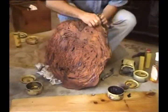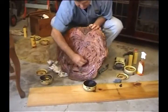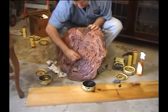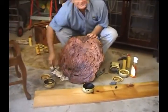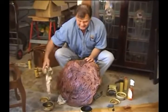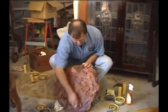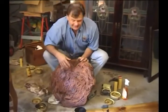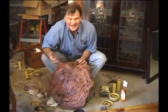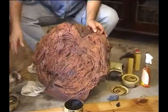And if I want to add the colour, I've got here a mahogany. I use my fine steel wool — I'll just tear a little bit off. Take the mahogany citrus shield and rub it in. You'll find that lovely reddish tint coming through. Just go on over that hole there. And look at that — that lovely reddish tint starts to come through. You can use any one of eight different colours to get the various tints that you want. I let this one dry about 10 to 15 minutes, then I rub it off. And with citrus shield, I always get a lovely shine — it shines more brightly, it's got a higher shine than feed and wax, it's designed to have that. So there you have it. That's where I filled the hole, using that piece of citrus shield that I had dry for about a month.